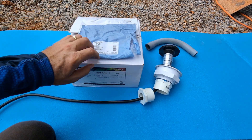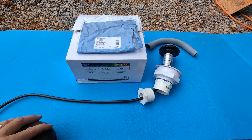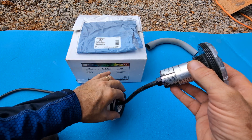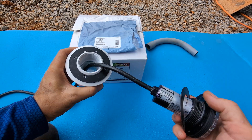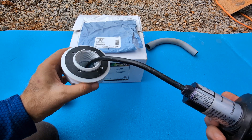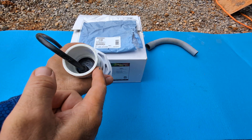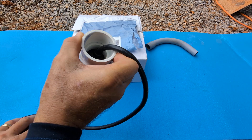I want to show you an issue. This first time I did these lights in a pool, the first lights I used were some Omnilogix and while expensive, they did fit. So the problem we ran into with these lights is the body of the light itself. Somebody may know if there is an adapter that actually makes this thing fit a regular Hayward inlet or return — I think it's the one-and-a-half inch, your standard return. But this light, the body of it would not fit all the way through our adapter. This adapter is just a regular PVC schedule 40, one-and-one-half inch adapter.